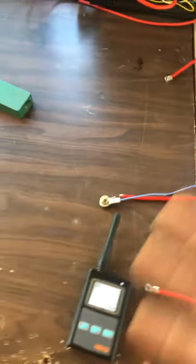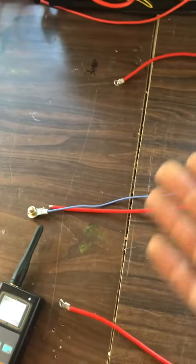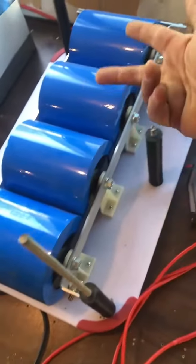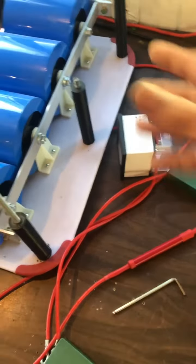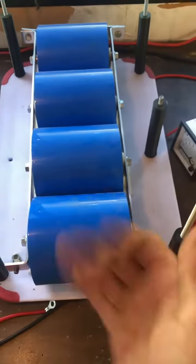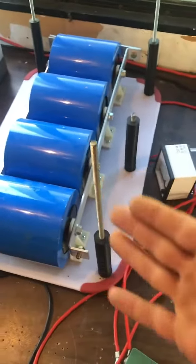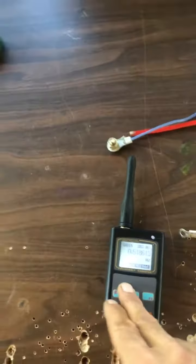Maybe a little less, maybe a little more — somewhere in there. If I turn it up, it's well over 12 kV a side, so 24 kV real easy. I'll probably put two caps together in series, midpoint them but not ground it. That gives me 40 kV potential on my cap at half a microfarad — 0.5 microfarads. Then I would match the resistance to bring me right into 16.8 kHz, and that cap at half a microfarad should be in resonance at 16 kilohertz.